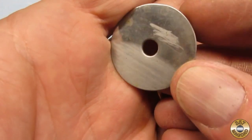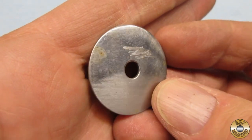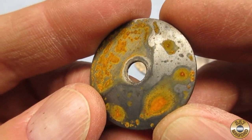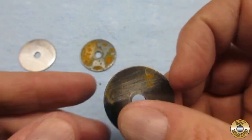I'm really impressed with how well the Johnson's paste wax protected the polished steel washer. The cold blue washer was the most corroded — especially the areas where the cold bluing was removed with a pocket knife and scotch-brite.